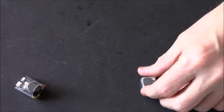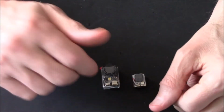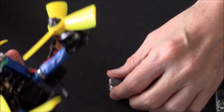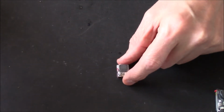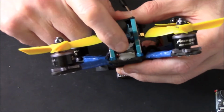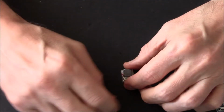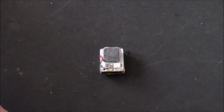Right, so it's really more of a recommendation here. If you're going to be flying something like one of these tiny little quads, 2-inch, 3-inch, I recommend the new-ish buzzer, the FullSpeed. Right, this one here, I've got one in there. You probably see it actually. I was using the Hellgate buzzer, but that got damaged and they're quite expensive actually. So I moved on to these FullSpeed.